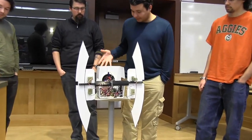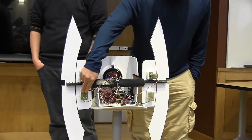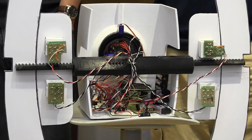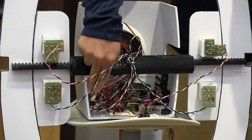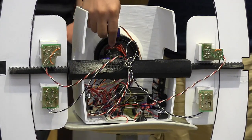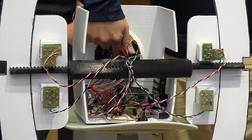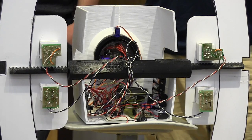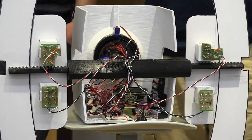So here we have all the guts of the thing. We've got several LED arrays here on the sides to simulate the gunfire. We have an LED array around the eye that you saw - that was the ring. We have an Arduino controlling the input from the camera. This is the motion camera right here, and it specifically tracks colors and motion of colors. We currently have it set to track orange and it'll just follow it wherever it goes.